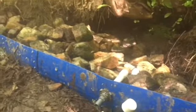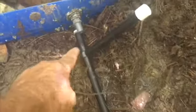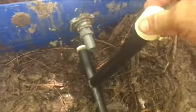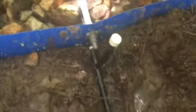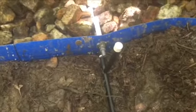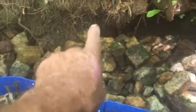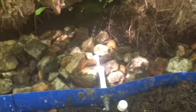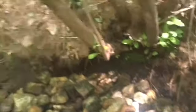Here's what we've done so far: I replaced that simple drain pipe coming out of the dam, put a three-quarter-inch T, and put a piece of pipe up with a cap loosely fitting over it, cut on a notch — this is just the air vent so you don't get water lock if there's a little bend going down the hill, like a vent on a commode or sink drain. We got rocks piled in here with a gradual slope coming down to the top of the dam, and we'll put the bleach bar in before we cover it up.